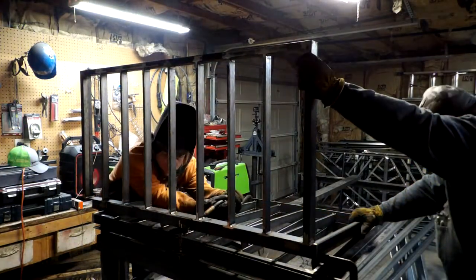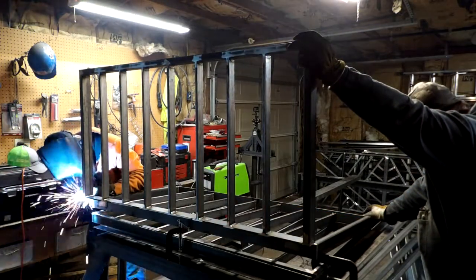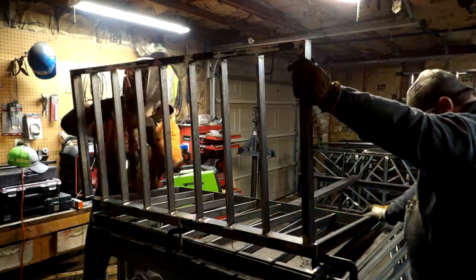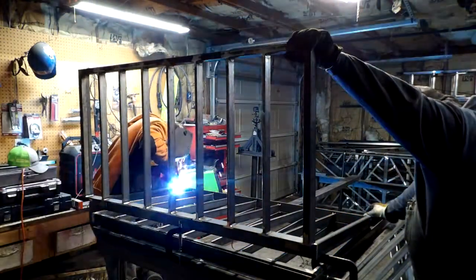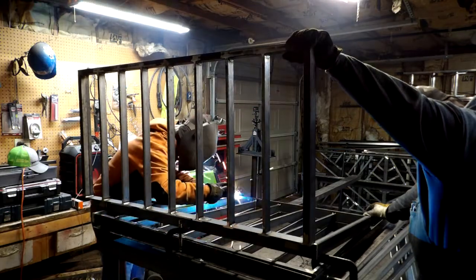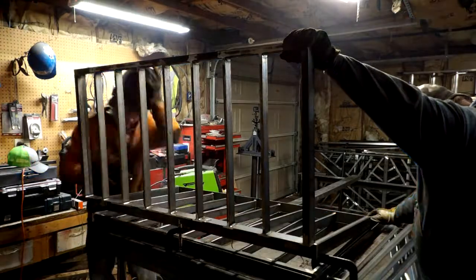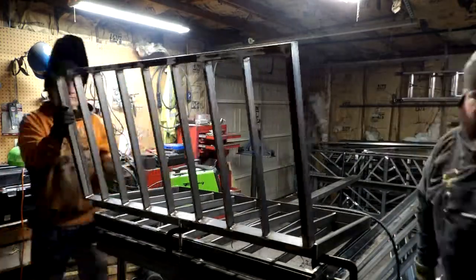And so now we're just kind of finishing up the welding. Everything was locked in. Typical practice for us is to put everything in and weld one side of everything. And what I mean by that is basically, as everything is sitting flat, we want to put in as much as we can on the first side. So I like to try to do 75%. That way when we flip anything else over, we've only got 25% of the welding left to go. That, and the more you're able to get welded on the first go around, just ensures that your part you're working on is going to be that much better and locked together.